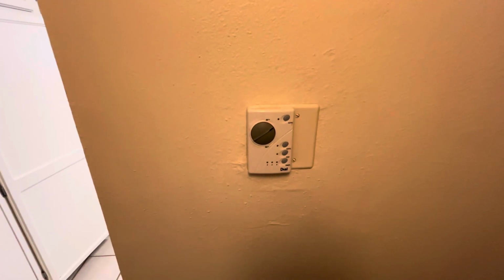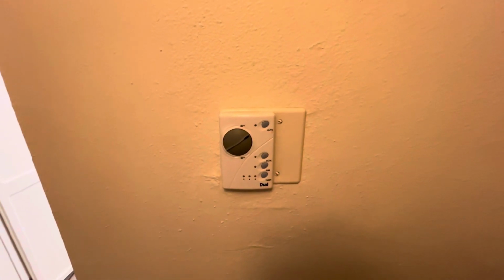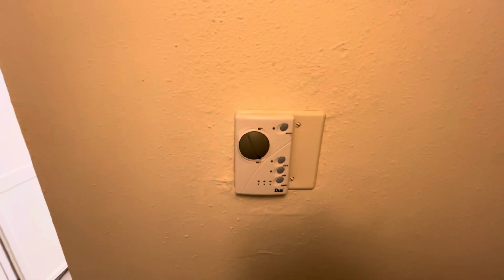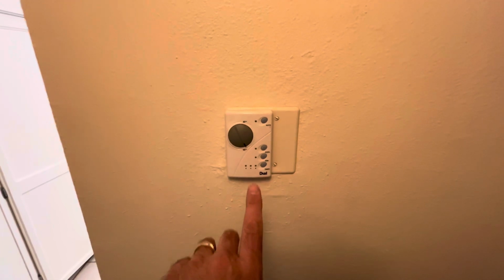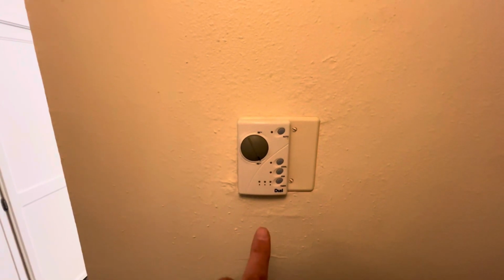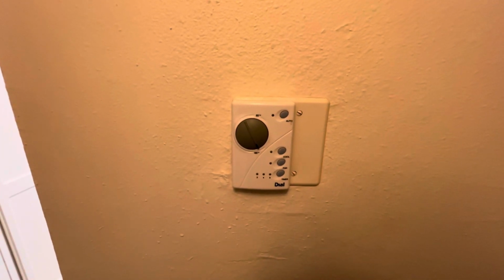As I showed you at the hardware store, you have two types of controls for a swamp cooler, evaporative cooler. You have the manual control, which just has a dial. You turn it to where you want it. Low cool, high cool, fan only, pump only. I replaced that with this thermostat, so we can set the thermostat at the temperature we want. It automatically turns on and off. Now the nice thing about this one is it also can sense how hot it is, and it will switch the motor between low speed and high speed. So if the temperature inside is close to the temperature set on the control dial, it'll remain in low speed. But if the temperature difference from what is set and what's in the house is too great, it automatically switches to high speed until it cools off, and then it kicks the motor down to low speed, which is very convenient.